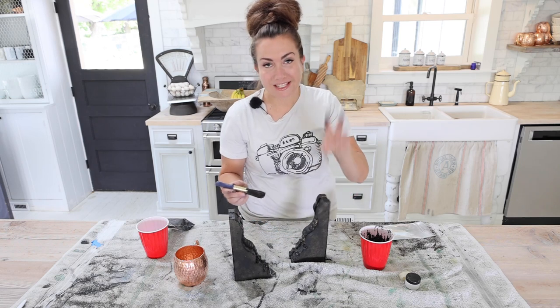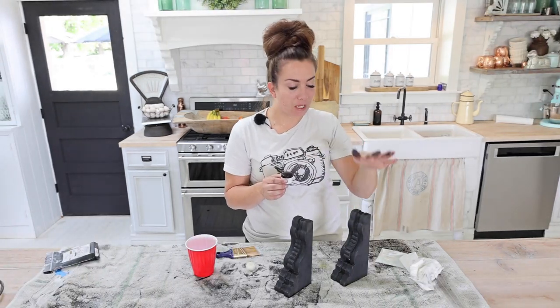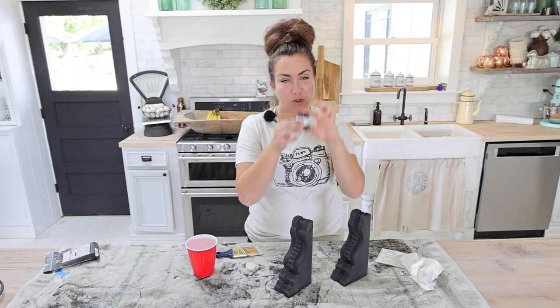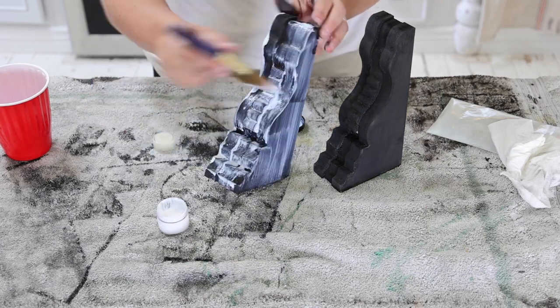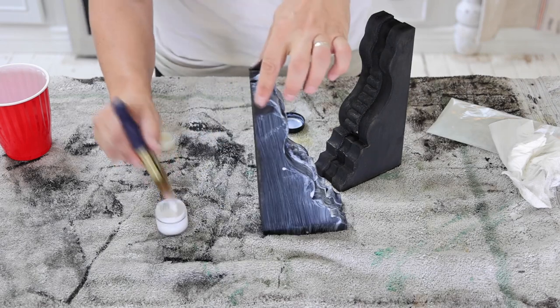Really you're just staining the corbel. The next step is going to be creating a resist, because if you just paint milk paint over the top of MDF it won't crack — it'll just soak in. So you've got top coat and you've got wax. We're going to do the top coat first, wax a few areas, and then we'll be ready for the last coat of paint. This doesn't need to be neat; we're going for a crusty, crazy, chippy situation, so just get it on there.